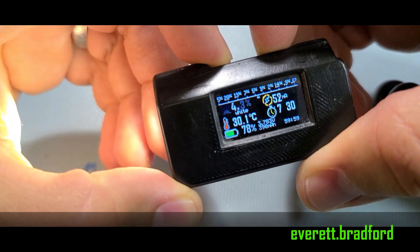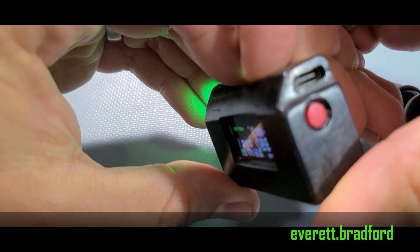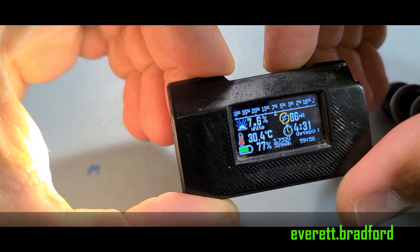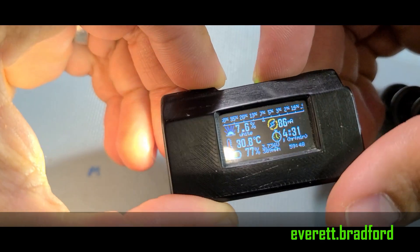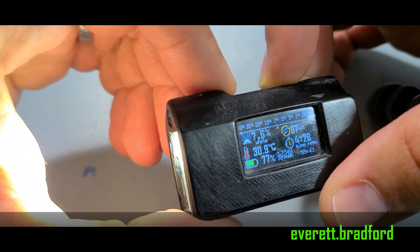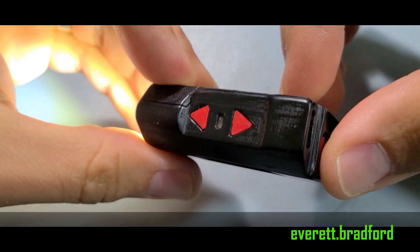Features include adjustable brightness, red, green, and blue color modes, ultraviolet, a green laser, USB-C rechargeable, temperature control, battery power instrumentation, a graphical color display, a tail switch, up and down switches, a touch sensitive panel, a tail cap magnet, and all the functions from my previous flashlights — strobes, configuration options, automatic shutdown, etc. I managed to fit all of this into a final size of 51 by 30 by 17 millimeters.